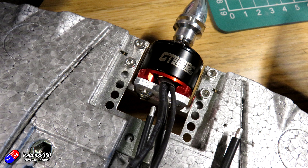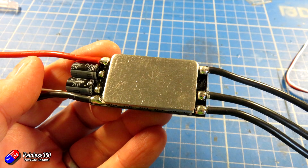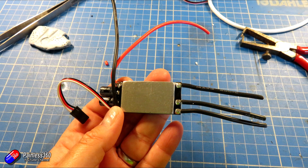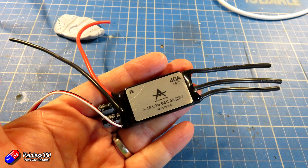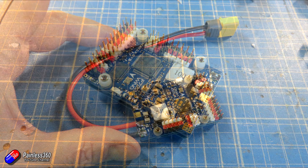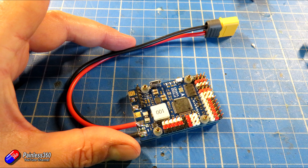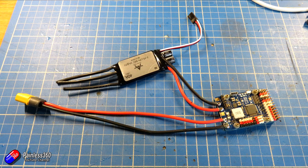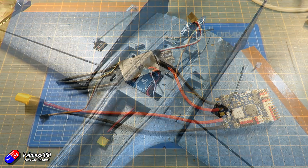To modify the ESC, I took off the wrap and started snipping the wires — putting shorter leads on, nice silicone flexible wire of the right size, leaving the outputs and doing it in a way that makes it easier to fit. Putting heat shrink over the top and replacing the label makes it look nice and neat. Next job is to prep the F722 flight controller — solder all the power pads so we're ready to put those wires on, solder the leads from the battery onto the input position, which will need to go through the wall into the battery bay. Then with careful measuring, cut the ESC cables so it fits alongside without lots of excess cable.